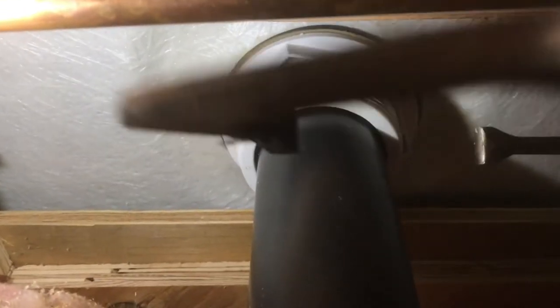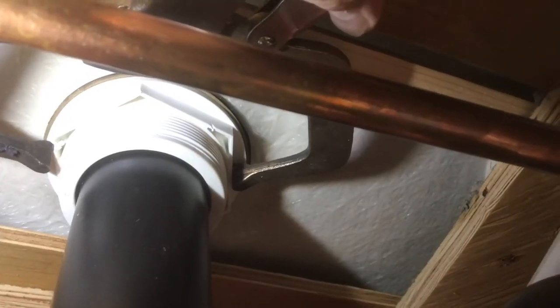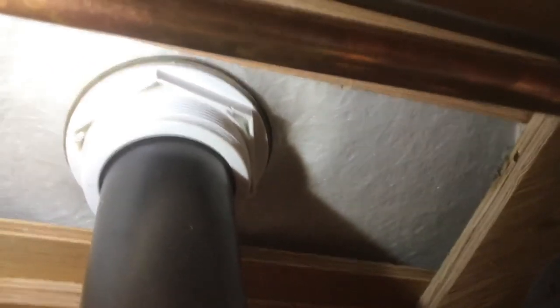There's the p-trap and also the drain, and there was actually a leak that came off of that drain. What I ended up doing is taking a pair of vice grip welding pliers — I adjusted them so they were just almost tight — and I was able to put them up there to tighten that. I had already tightened it when I shot the video, but I just wanted to show you how I put it up there.